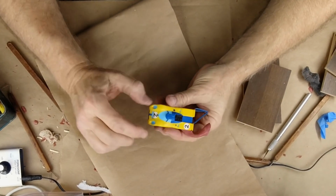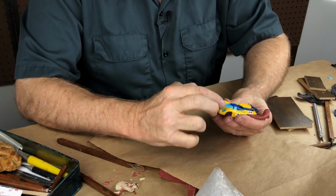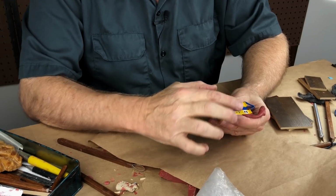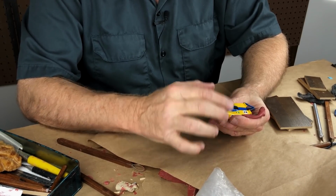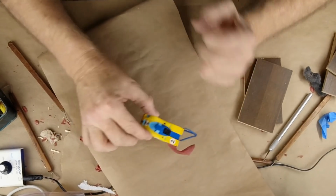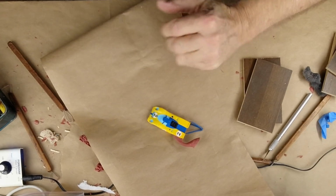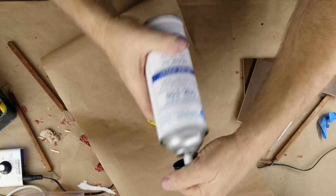The idea here is that the rubber that we poured yesterday has created the parting lines. Those surfaces, those blue rubber surfaces, are going to be the parting lines for this piece. So what's going to happen is I'm going to spray this front side, spray these parts with release, this stuff, so that the rubber will not stick. And you've seen me do that before. And Jeff's base, for instance, I did the exact same thing where I used a parting agent to keep the rubber from sticking to itself. But here's the thing.